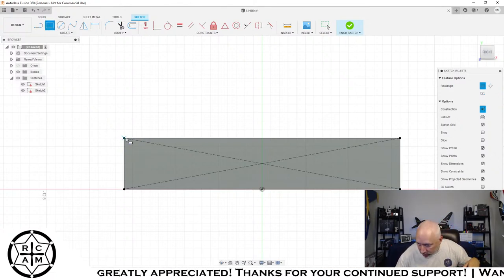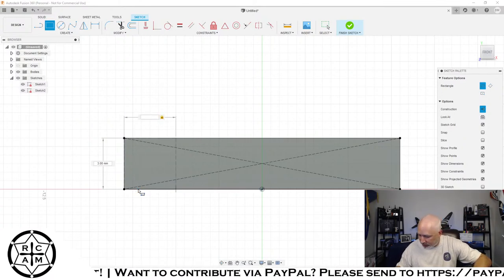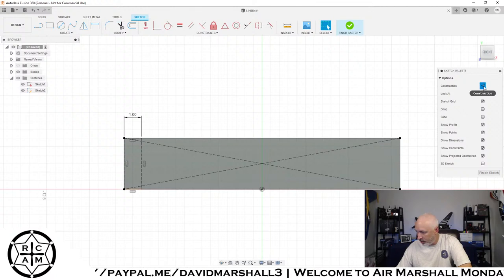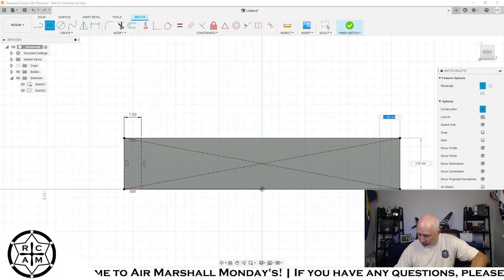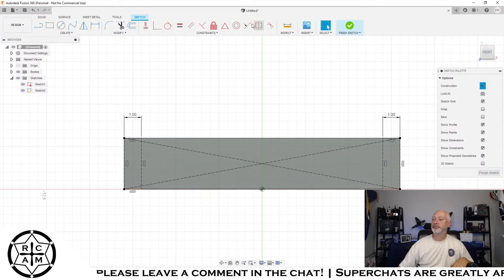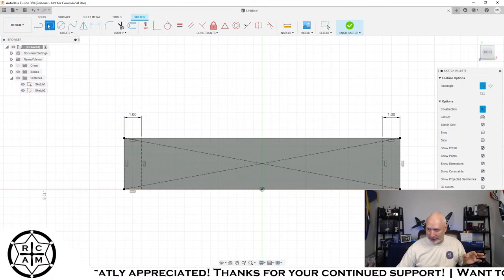So I'm going to do a construction rectangle. Uh-oh, that's not what I want. I want that to be 1 millimeter. I'm going to do another construction rectangle here on this side. That is also 3 by 1. We know that we've got about 1 millimeter of material on the sides that's going to hold it up. And then we're basically going to start drawing little grooves into this. You'll kind of see that play out here.